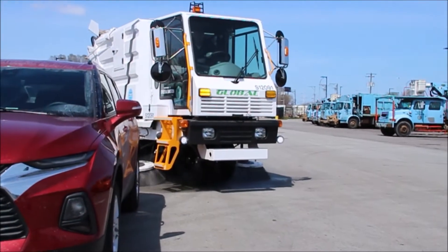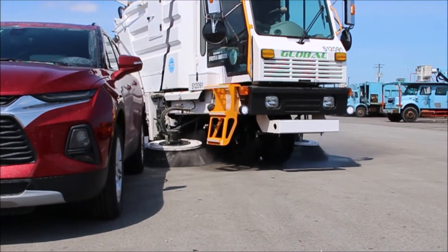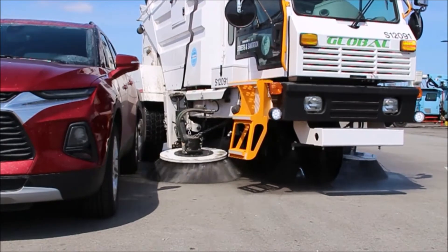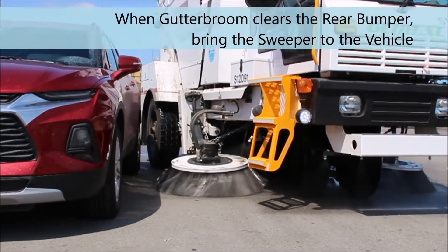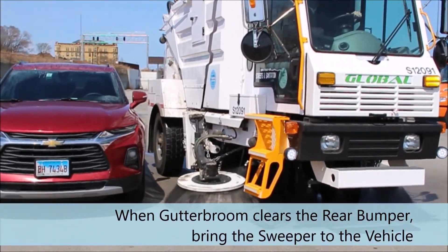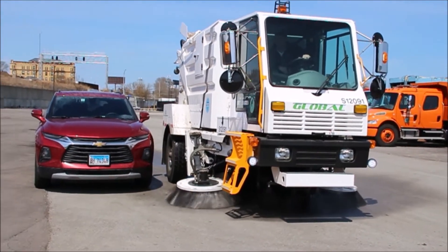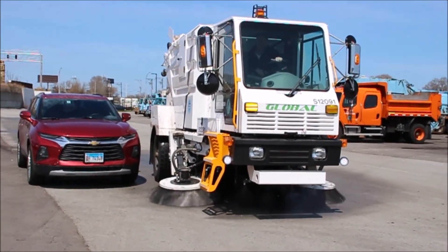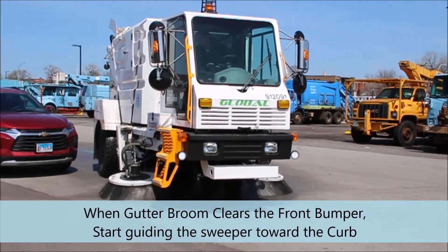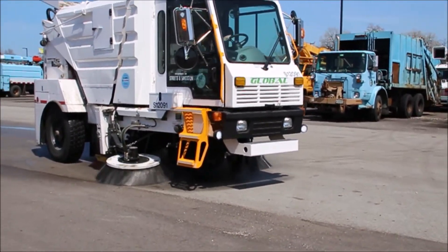Because I don't have the back-end steering that would cause tail swing, as soon as my gutter broom reaches past the vehicle itself, I can turn and cut back in. The rear fender of the sweeper will follow the gutter broom. So as my gutter broom gets past the vehicle, I can slowly start to turn and come back in to the curb line, with enough clearance to get back on the curb line — no counter or tail swing, and no worries of any interference with the parked vehicle.